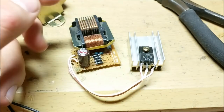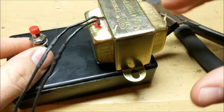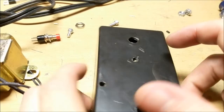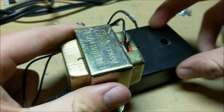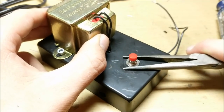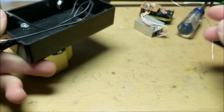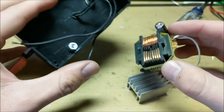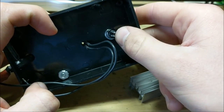After the circuit board has been assembled, it's time to make the box. I will drill holes in the box for the transformer and the button, and also drill holes for all the wires to go in and out, including the mains wire. After your box has all the required holes drilled, you can start adding the components, starting with the large mains transformer and the button. After everything has been screwed in and tightened with some pliers, it's time to insert the circuit into the box, wiring the 10 volt AC connections to the circuit board in series with the switch.